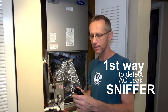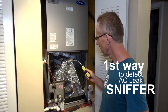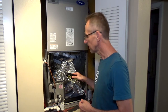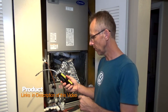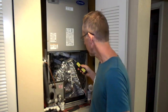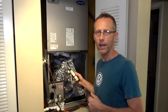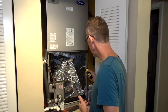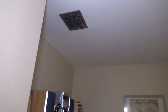One quick and easy way to detect leaks is a device my AC guy brought — it started beeping in certain spots, telling us there was a leak. I bought a similar device for $20 — I'll put the description link below. All you do is turn it on, wait a couple of seconds, adjust sensitivity with the wheel, and if it detects a leak either in the coil or outside — even in your car — it starts beeping.